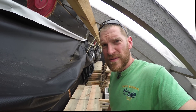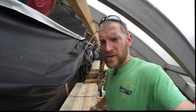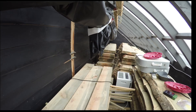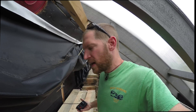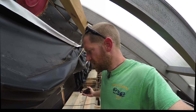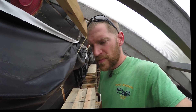I'm running a dehumidifier in here — it's a 70-pint dehumidifier. The best it can do is 30% moisture content in the air; I haven't been able to find anything that'll take it below 30%. But it's doing really well for helping my dry times. For one-inch lumber I'm getting stuff dry in about three days. The kiln is hitting about 130 degrees every day — right now on this overcast day it's about 90 degrees in here. Humidity spikes to about 40% in the morning when new wood goes in, then the dehumidifier brings it back down to 30%.